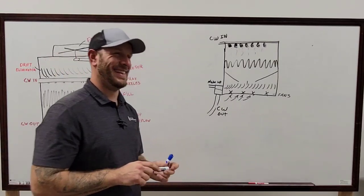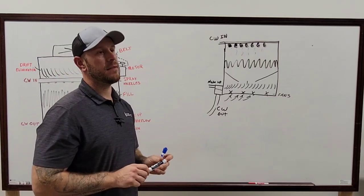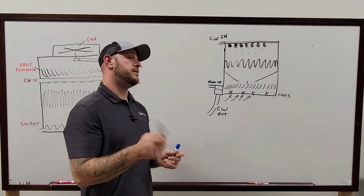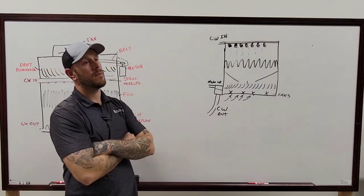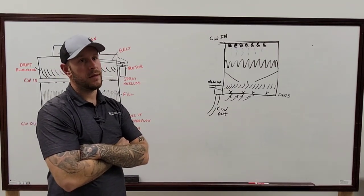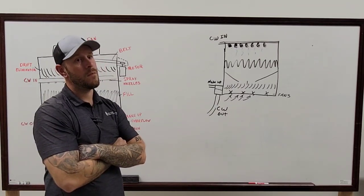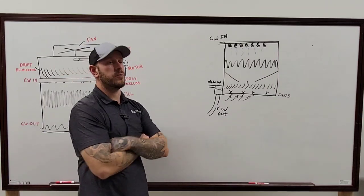Maybe a horrible question. But you just said the fan bearings are bad. So my question is, we can take the load off the motor to test those bearings, but we can't take the load off the fan and test those bearings. Unfortunately, no way. But if you take the load off and you were having bad readings on the motor, and now all of a sudden you've got a good reading on your motor, then you know that your problem is the fan.